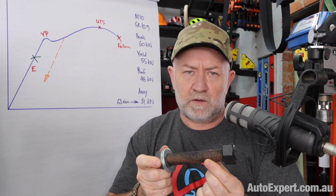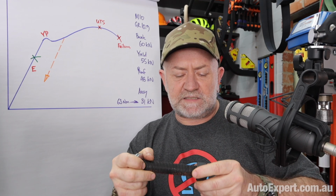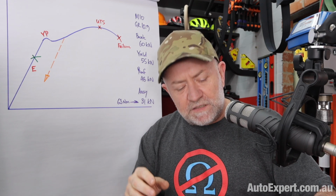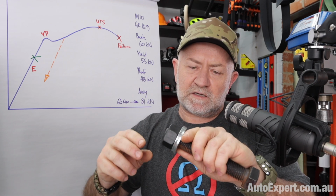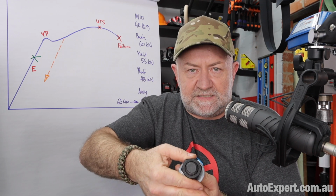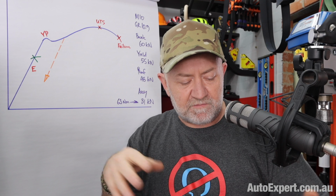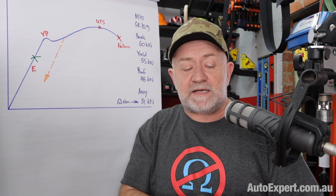Okay, and there's not very much friction at 20 newton meters because the friction is proportional to the amount of tension in the bolt. The more tension there is clamping the thing down, the harder it is to move the head and the face of the nut and the threads against one another. Okay, so 20 newton meters, not that much friction, reasonably accurate. You take the play out and you get to all the parts being bound up together nice and closely like that, and then maybe the spec says you go 90 degrees, and 90 degrees equals stretch equivalent to a quarter of the pitch of the thread, equals whatever elongation of the bolt, equals whatever tension is required to keep the bits together reliably. So that's always nice when that happens.